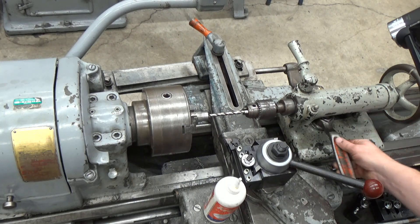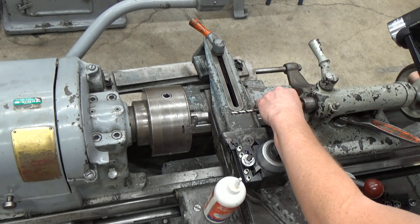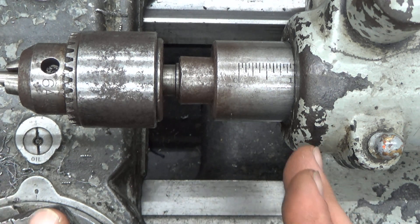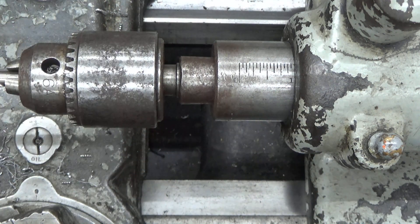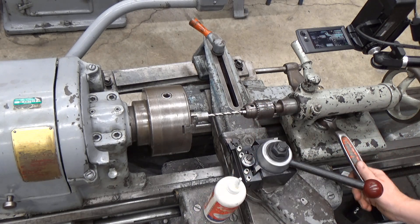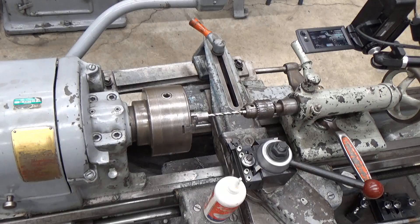Get that lined up so it's just starting with the work. We can verify the depth of the drill by using the gauge on the quill here. Sometimes I'll get this started at a nice round number — I've got it set to 1 inch. So if I'm trying to get the drill to a certain depth, I'll start the quill at an exact 1 inch mark, then slide the entire works over so that it's touching the stock, tighten it down, and then use that mark as my indicator while I'm drilling.